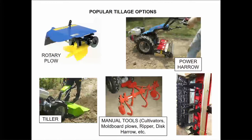It's using an auger, as you can see. It's a spiral, so it's digging in. The PTO power is screwing itself into the ground as the tractor moves forward. So it just discharges the soil to the one side as it's going along, which is why they class it as a plow, because it's leaving a furrow where it's actually worked and discharging the soil off to one side, just kind of like a moldboard does. The big difference being, A, you're not using tons of traction to pull it because it's screwing itself through the ground, essentially. And B, it's breaking up the soil a lot more than just a moldboard, which just flops it over.